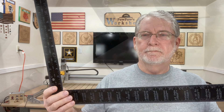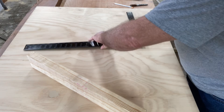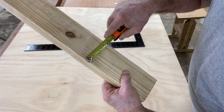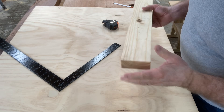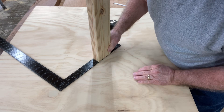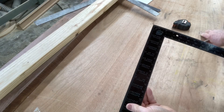The tongue is an inch and a half wide — and that's important because today's two-by-fours used in construction are actually one and a half inches thick by three and a half inches wide. So the tongue of the framing square is the exact same thickness as a modern two-by-four, which becomes very important when laying out framing.